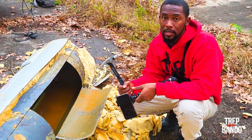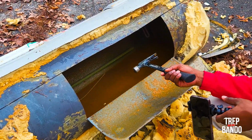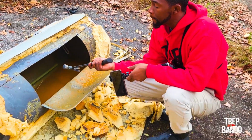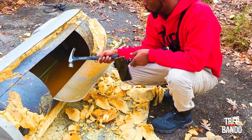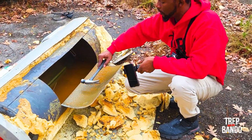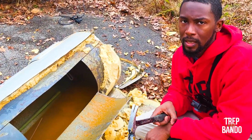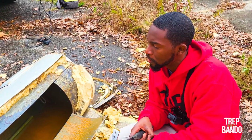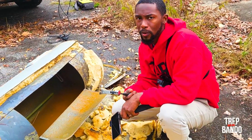Cut down on this. Because see, you've got a giant tank. We see how wide open this is. This is nothing but a giant water reservoir with a few heating elements. The tankless water heater doesn't have all this space in it. So really just this collection right here, what we see in this one area of the wall, if that built up inside those small elements, the tankless is ruined. So you have to filter the tankless more so than anything else, because this can happen way too quick.